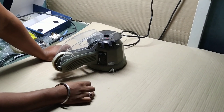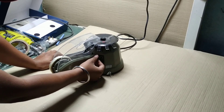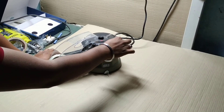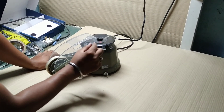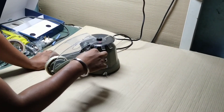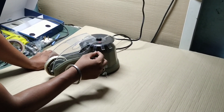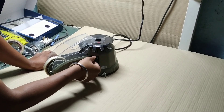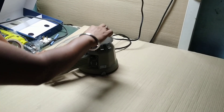Operation is very simple. There is also one more thing — this is the rotary knob to adjust the gap between 2 tapes. Here you can see the gap between 2 tapes is around 1.5 inches, so only 6 or 7 tapes can be cut at one time. If you want to increase the number of cutting tapes, you can rotate this knob to the right direction or left direction to change the gap between 2 tapes.